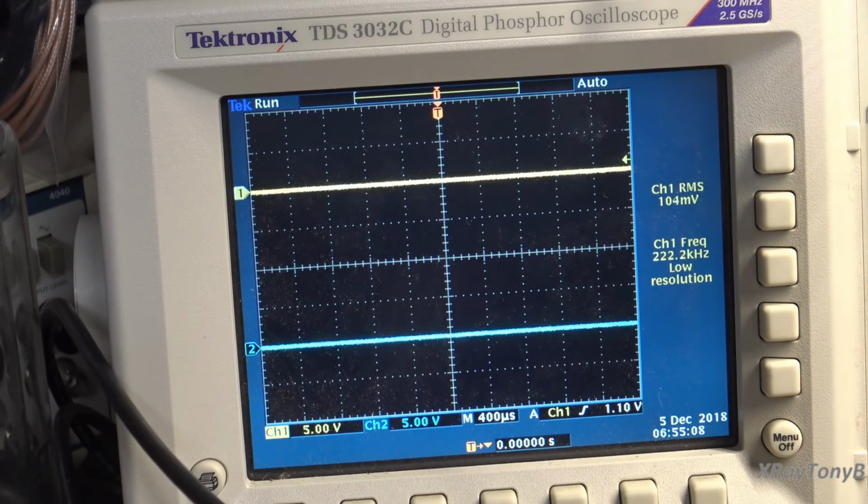I started ramping it up a little bit on my 1800 watt isolation transformer, and the transformer started to sag. It couldn't take all the power, so I had to plug it directly into the wall, which is not a problem on this. So it looks like this thing's working good. Let's check some distortion.